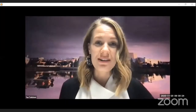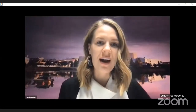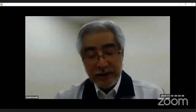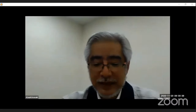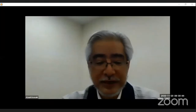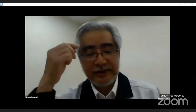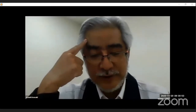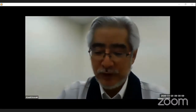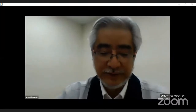Do you see an effect on the noise level with using IMSE, or implications for reliability, when in IMSE structures there are fewer parts and fewer mechanical interfaces? Okay, so noise is a key point for haptic feedback. I mentioned 200 Hz. This is in the audible frequency range, so nobody can escape from some sound. There is a possibility to reduce sound with a damper or counter pulse or waveform or vibration direction, etc. But in any case, it is necessary to consider.